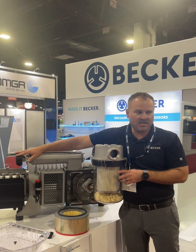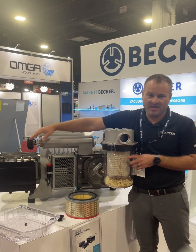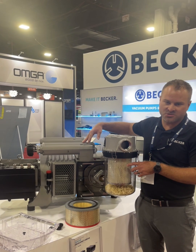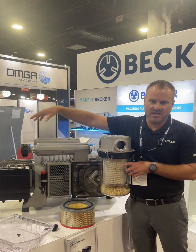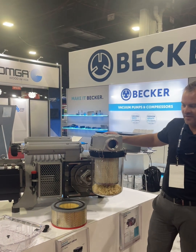This little hockey puck-looking device is our cyclonic filter. There's no cartridge inside — it's just a fan that spins. When the fan is spinning, because the relief valve is drawing, it ejects any debris that could be pulled in directly down away from the internal air filter.